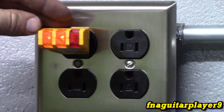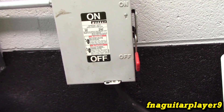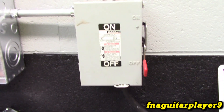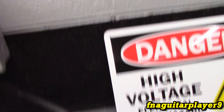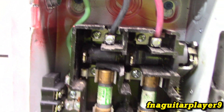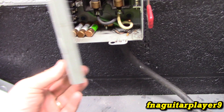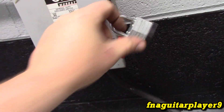I just got the 240-volt disconnect connected up. If you're wondering what it's for, a lot of times I'll test electric motors and it's nice to have a 220 hookup. I'm going to disconnect it - it's tied into a 30 amp breaker that I'll keep off, and I do have a lock for it just in case. Everything wires up pretty straightforward. I got a terminal block here so I can hook different things up. I also have a variable frequency drive and a three-phase motor and have videos on those if you're interested.